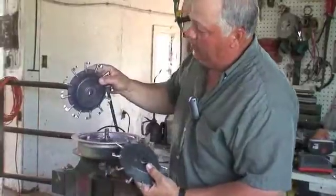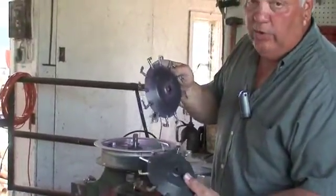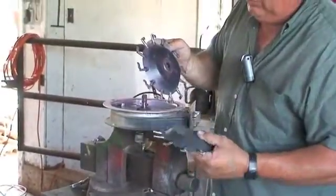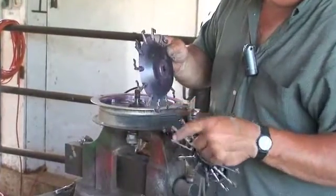This is the long finger pickup that we use for corn. These are the short finger pickup that we'll use for a lot of the oil seeds because they're a small seed. If we were using a confectionery seed, which is a lot longer seed, we would use longer fingers.